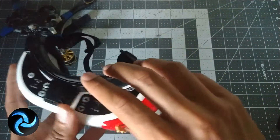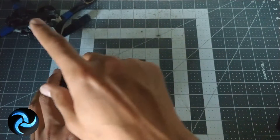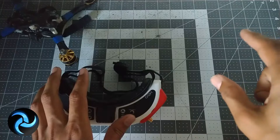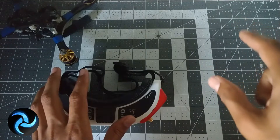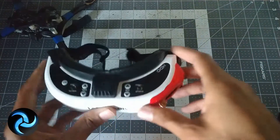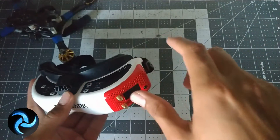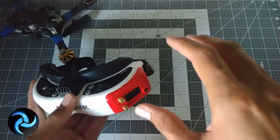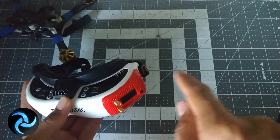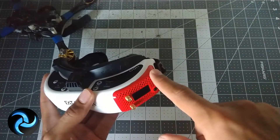When your goggles are drawing an image, they start at the top left and begin drawing pixels. You've got a signal going up and down telling you what should be drawn there, and at the end it does what's called a horizontal sync pulse. That's basically the signal going low and saying 'we're at the end of the line, go ahead and start drawing the next line.' In our scenario, sometimes that pulse gets missed, and when it does that's when you get tearing, scrolling, and all the really bad types of breakup — when the image is no longer a square image.